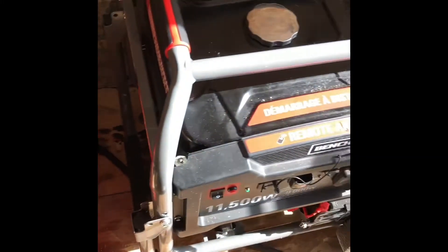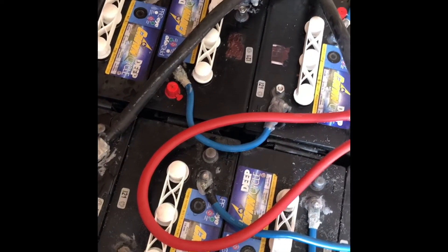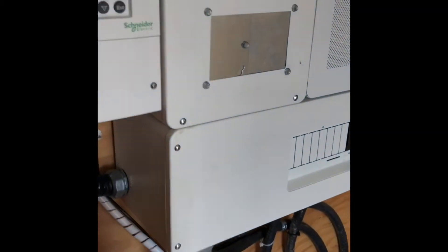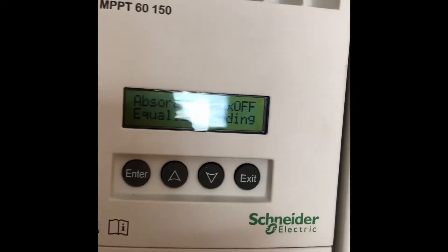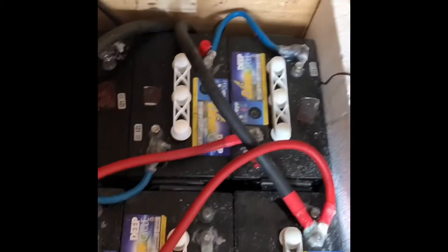The equalization — we're going to do it all with the sun today. We're not going to have to start the generator, because that might take three or four hours. So wait for a really nice sunny day like we have today. It's 12 noon and they're in float. It has to go into float cycle, then you scroll down, press enter, scroll down, enable equalize, and you see 'equalize pending.' It'll boil, then equalize, then go back into float, and the batteries are good to go for another week or so.